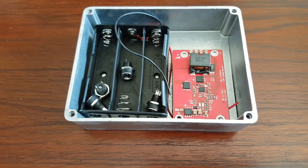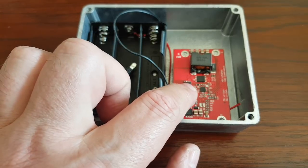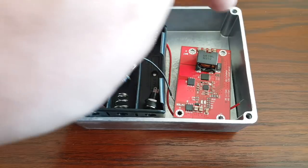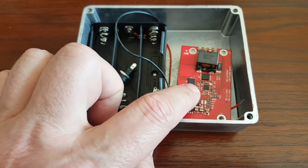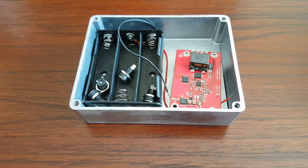I also plan on making a battery pack using a cast aluminum case with an 18650 cell holder, an MPPT solar charger board, and a battery management system — a balanced BMS — to charge those cells. This costs about $15 and the BMS is about $5; cheap stuff from China, but it does work. If you need to make battery packs for more complex, higher current-draw systems, I highly suggest you check out Julian's channel OH8STN at Survival Tech Nord — he's an expert on the subject.